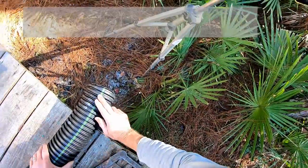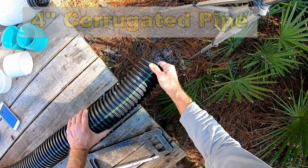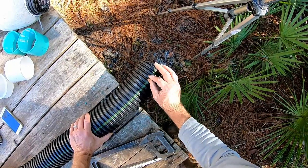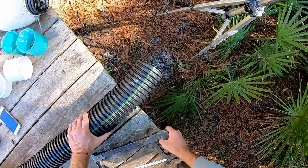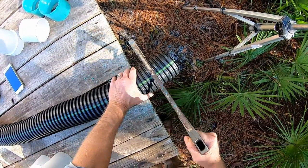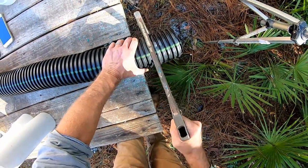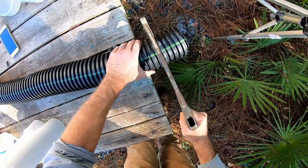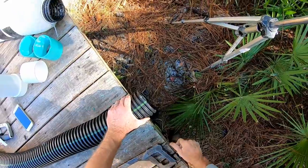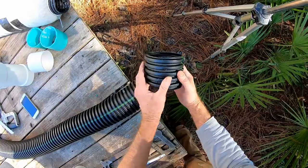This is four-inch corrugated pipe. You can see it's a very strong material — that's why they've got the ridges in here, which gives it support, kind of like a bridge. The arch is what gives a bridge support, and it's the same thing here. With the hacksaw, cut square down through here with a nice full length of the saw, and always cut clean through. If you do, you'll have a very nice piece of pipe.